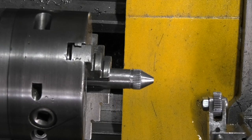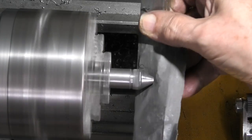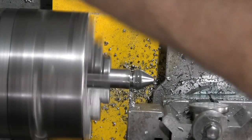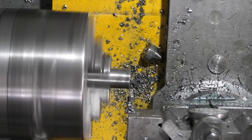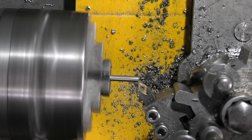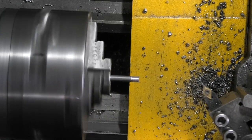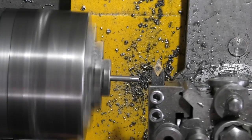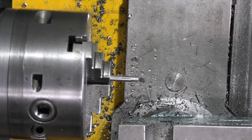That's just to get a grip, and before I part that off I need to give this a polish up and take the sharp edges off. I'll put a 3/16 bar in to make the handle, then put some oil on and bring my die head in.